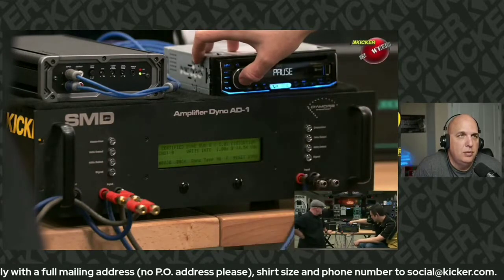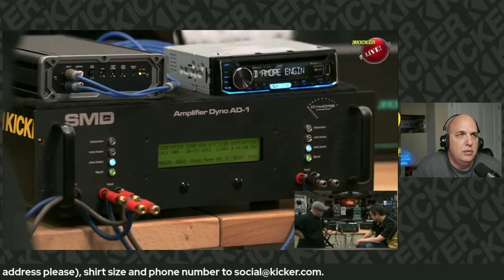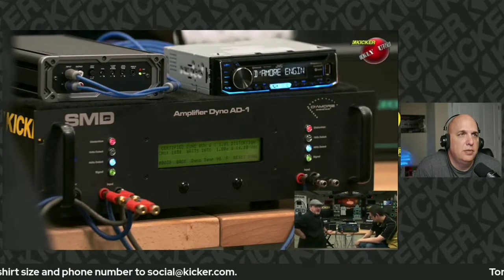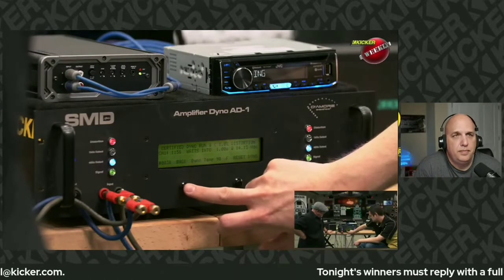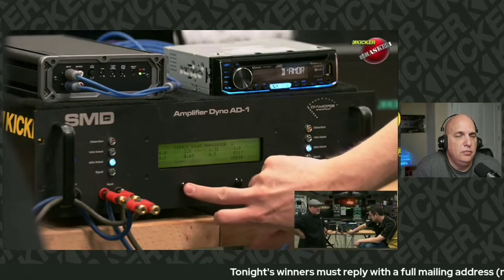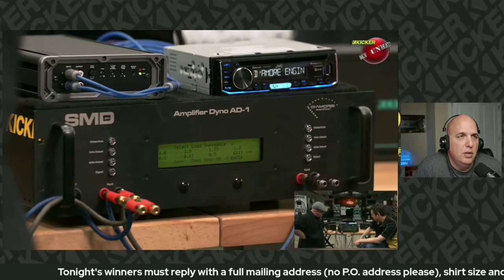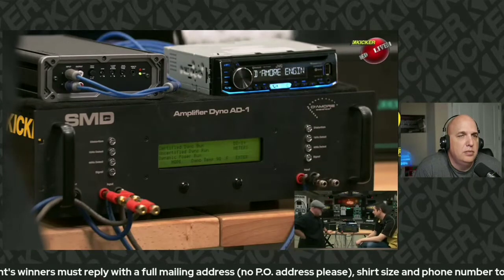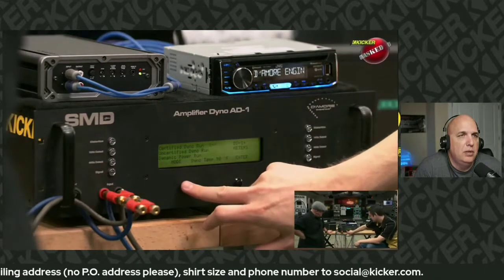So that all has to do with the efficiency. So let's hit this one again. And the interesting thing Ken was pointing out earlier, 1156 at 14.1. Yep. All these dyno runs are actually showing more power than what the birth certificates even show on the amplifiers. Right. So yeah, the 2 ohm run. All of our birth certificates are going to be at the rated power, 2 ohm or 1 ohm, depending on the amplifier model. Well, let's do the 2 ohm rating.